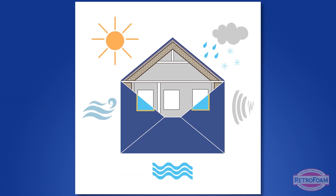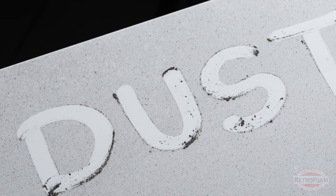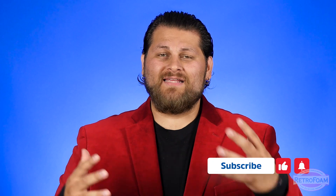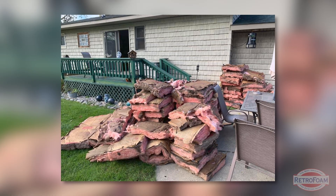You want it out of your house. I can't stress enough — if you're re-insulating your house with foam, you are establishing your building envelope on the outer layer of your home. What that means is that old, nasty insulation on the floor of your attic is now inside your home. It's inside your air. Your indoor air quality will absolutely go down and be affected. Another thing is odors — if there's anything inside that existing insulation, that's going to cycle throughout your home.